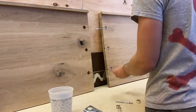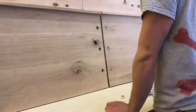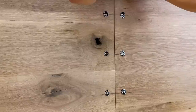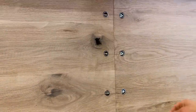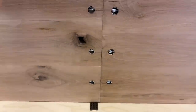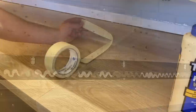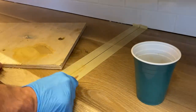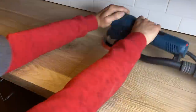Now that the slabs fit perfectly, it's time to fasten them together. Because we pre-drilled everything, the assembly is fairly quick and easy — mostly a matter of tightening properly. The ball of the tight joint fastener has three or four holes on the side; you use a scratch awl — basically a pointed screwdriver — jam it in and twist upward. Every twist pulls the slabs closer together. It took me about ten minutes to tighten all three fasteners. I apply masking tape on both sides of the seam, mix wood filler with leftover sawdust and wood glue, apply it into the seam, rip off the tape, let it dry, then sand it down for a perfect crisp even edge.